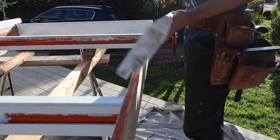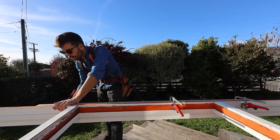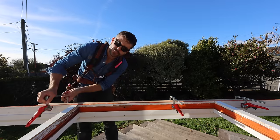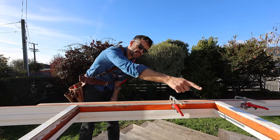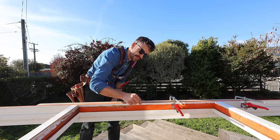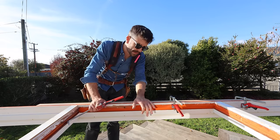This little block of wood on the top here that I'm adding on is to support the future window. See, if I don't add this and I screw hinges to the top, and then we put gas struts on this window to make it open up, all that pressure is going to be pulling on those hinges - and if we're only into 20mm of timber it could rip them right out.